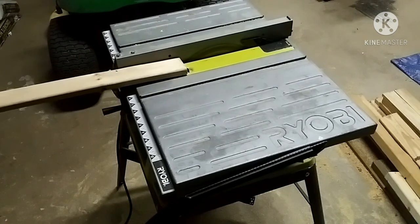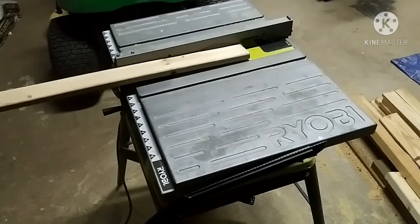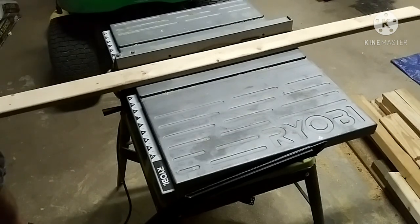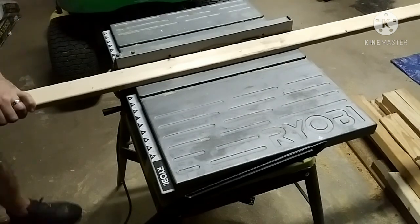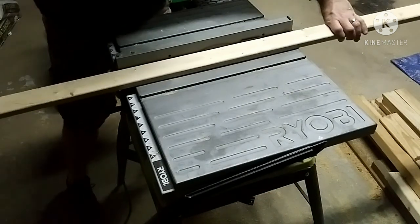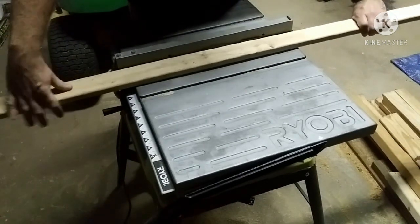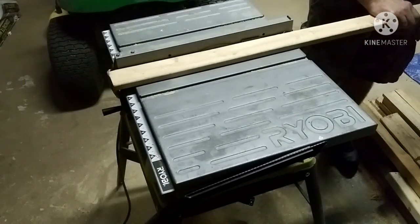And it's always kind of a struggle because as we cut these out, if the board isn't held completely straight, it's easy to break the thin piece that we're getting. So you'll see, I'll hold it up and show you how thin of a piece we're cutting. And these don't have to be perfect as far as how they fit in. I do put a couple specks of glue to get these to stay in that groove, but most of them are thick enough where you could probably wedge them in there and they'd stay.